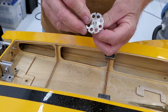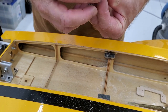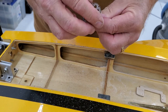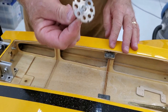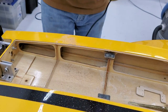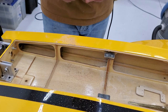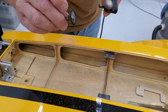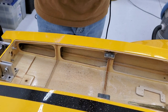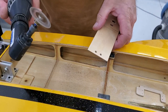Another cool way to move material fast — they call this a diamond wheel, though I'm sure they're lying. It means a wheel that's got rough stuff on it. This is a quick-disconnect, a cool little Dremel thing — a little quarter-turn jobber. Put it in, quarter turn, and it locks in. This dude, you need to cut the back off, hook this up, and it flies through. It runs through material quick. These little sanding flappers — don't waste your money. A little thin cut disc, also on a quick disconnect — a whole lot slower when you've got a long ways to go in wood.